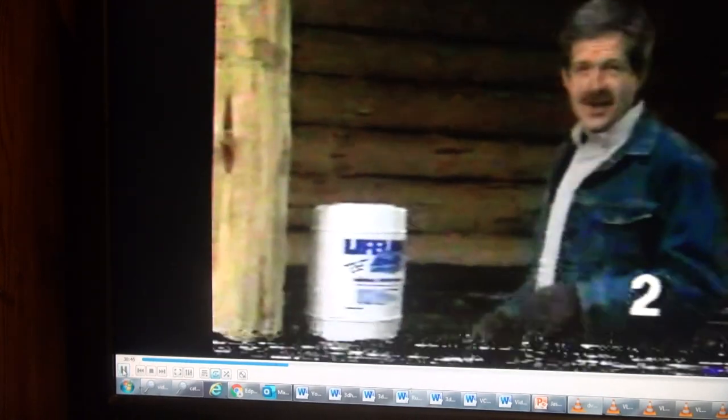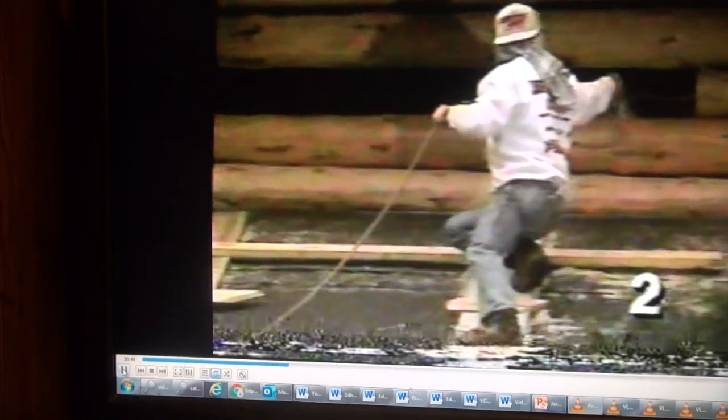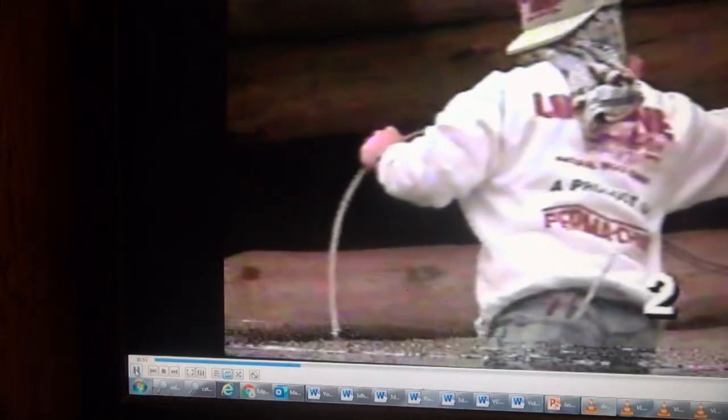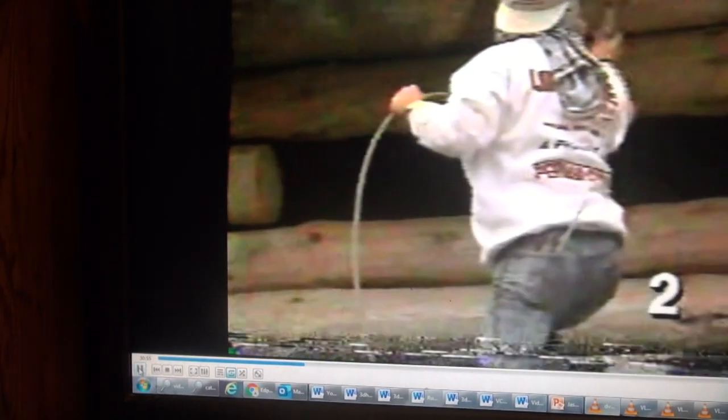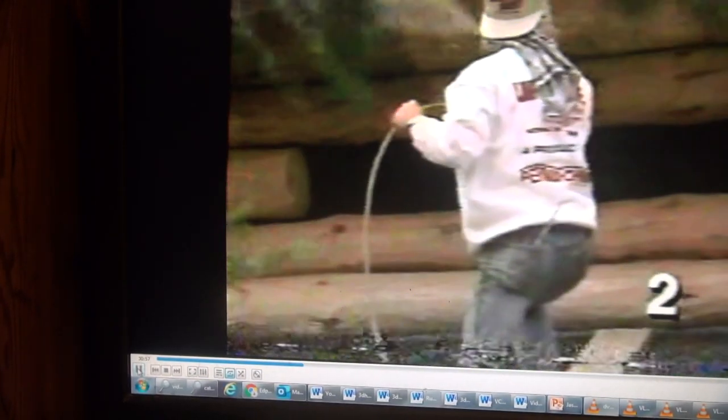Tom Tusek is upstairs working on it right now, using an airless sprayer to apply the stain. A brush or a lint-free cloth could also work. The surface should be completely dry before application, and it needs about eight hours of dry weather afterward for proper absorption. We also sanded down all the log ends to close the log grains, and contracted another pressure wash to remove all road grime and sawdust.